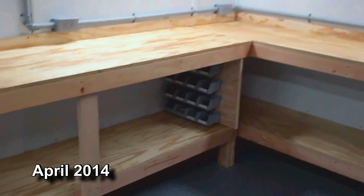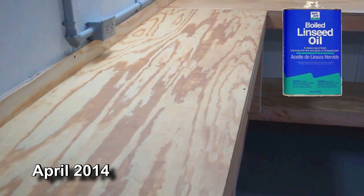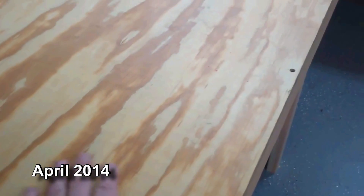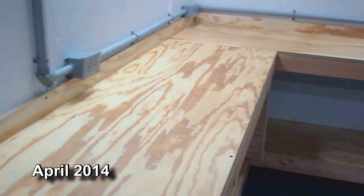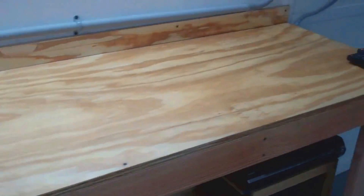I did actually a really good finish on the plywood. The raw plywood didn't seem right, so I took some linseed oil and some paraffin wax, melted it over the stovetop, then rubbed it in as best I could and took a scraper and scraped it all back down right to the wood. Once I let that dry I went back over with some boiled linseed oil, a couple coats later and it seemed good. A little paint on there will scrape right off and now at least it's not on raw wood.